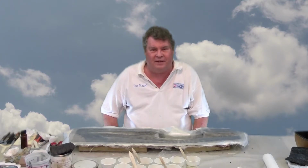When you're taking fiberglass parts out of molds, there are four basic techniques that you typically use. One is force. It takes a fair amount of force to break free a mold from a plug or a mold from a mold. And even though I put PVA and wax on the edges of the original molds, I may have gotten some fiberglass down on them. So I may have to do some trimming while I'm doing the demolding.